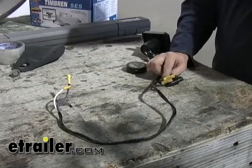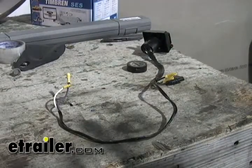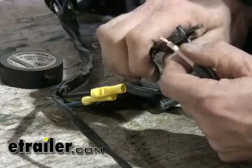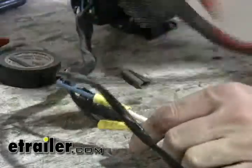Into our black and blue wires we're going to install a gray cable that has black and white wires inside of it. We're going to just peel away the gray sheath, strip the wires back and make your connections. We're going to go black to black and white to blue. Cover those up with some electric tape.